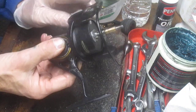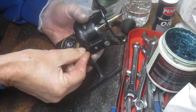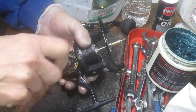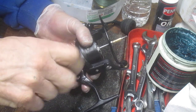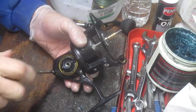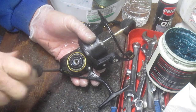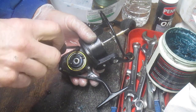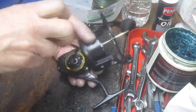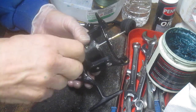The case locks easier, that's for sure. Let's see if we have play. With these, I don't tighten them all the way down until I get all of them seated well. If you tighten one side down, you might put pressure on the other side of the case, and that causes real problems with the operation. Just get them snug before you go back and tighten them all down. It's important to stay within the way the manufacturer does them. Now that I've got them all snug, I can go back and tighten those three down.